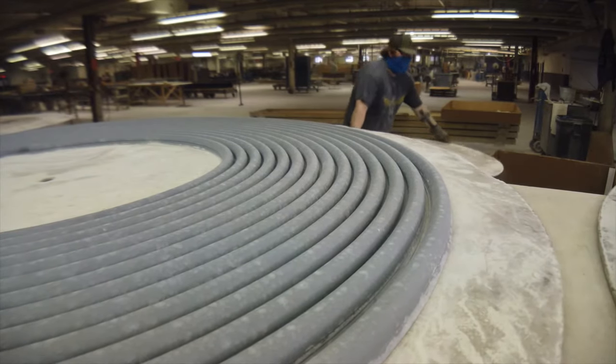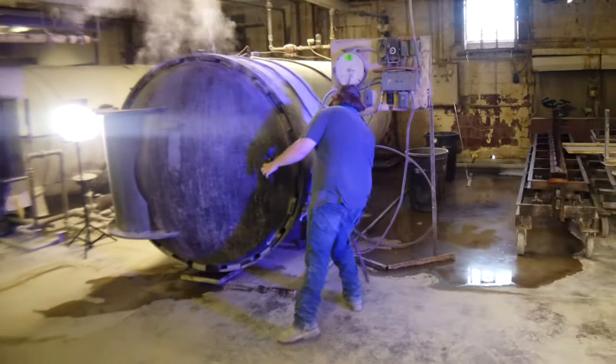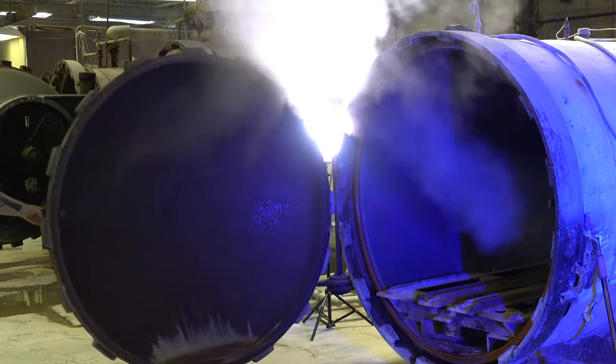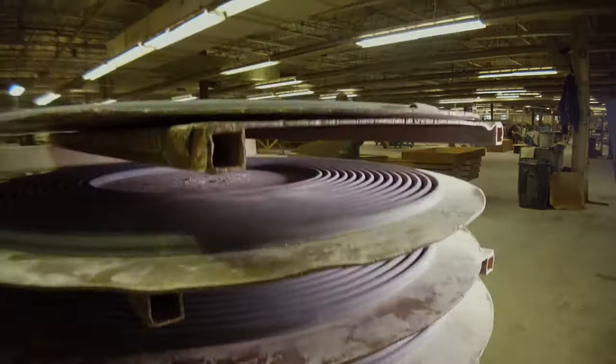On the conventional cure, which is steam cure, we extrude it and then we put it in vulcanizers — autoclaves — and cure the material. There are some materials that require that, and there are other compounds that can't be run with continuous cure.